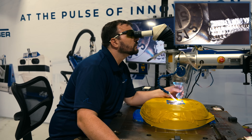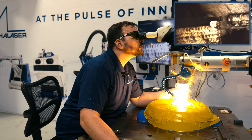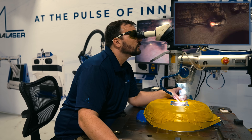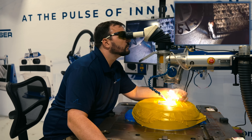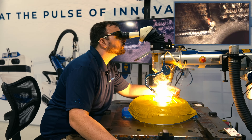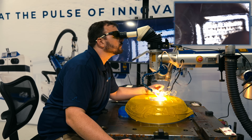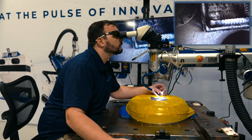The nice thing about using an Alpha Laser is he can weld right up against that timestamp without worrying about hitting it, so you can weld right up against sensitive areas without damaging them. Now he's going through and giving himself a border. He's able to weld close to that date and time stamp — it's very close, I would say around 10 to 15 thousandths away.